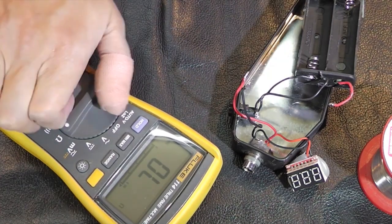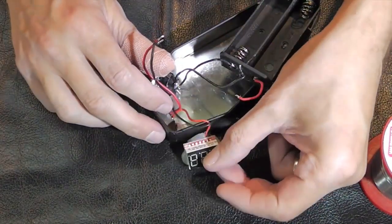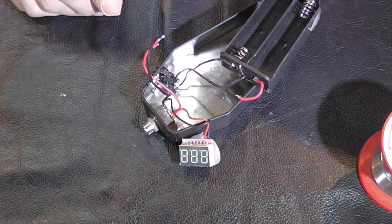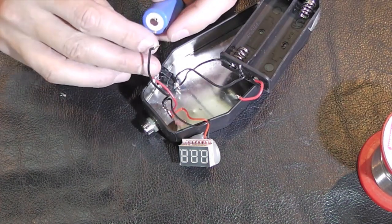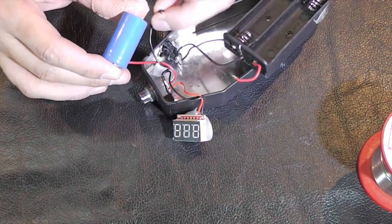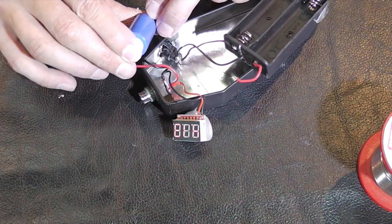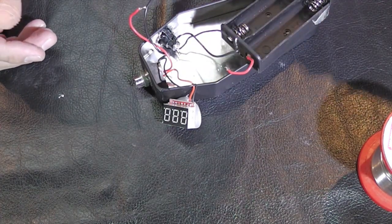The other thing I suppose I could test is the display, to make sure the display is still functioning correctly. Let me just reach over and grab a tiny battery. You might hear bangs, crashes and all sorts. I've got a tiny battery here, and the way this is rigged up, hopefully if I put the two bits, pos and neg, going up to the ego connection on there, I should get a volt. Yeah, there we go. So we know that's reading at 4.13. I know this battery is fresh off the charge, so that's round about right.